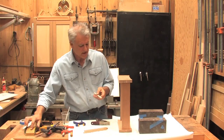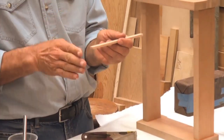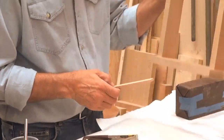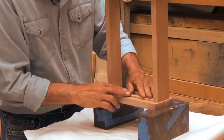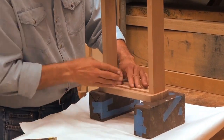These are the strips that I cut earlier. These are all now sanded and ready to glue in. I've also trimmed them down to a 7 3/4 inch length. There will be 2 strips that will go in both the top and the bottom, right here. This one will go in right here. And one of them, the one on the bottom here, this is for the floor stop, so I can screw my floor into this strip here.